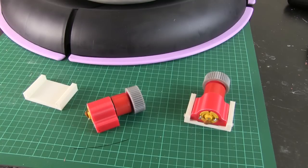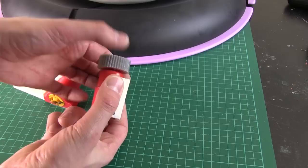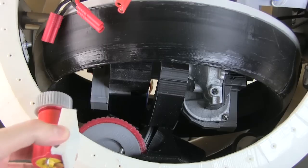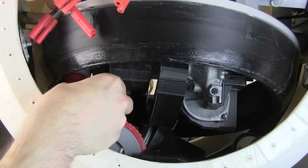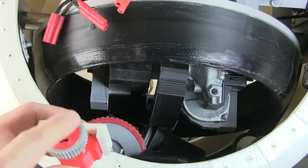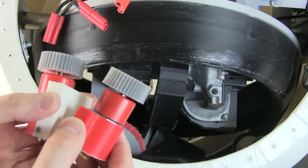We're going to try and spin this flywheel and see if we can get it to turn on the spot. I'm using the same motors as before — these are the Como Drill 918Ds, 30-to-1 ratio — and I've put them in these plastic brackets, each of which fits into another bracket that gets solvent welded onto the trousers. That can be hinged out and I can wedge something in there to apply pressure so it fits on the inside of the flywheel. I've moved the trousers and flywheel up so we can see underneath — I've got two of them, one that fits at each end. This pushes on the inside of the flywheel. My flywheel is slightly bigger than the last one so it'll go slower, but it has more mass and I've made the drive wheels slightly bigger so they should turn it faster.